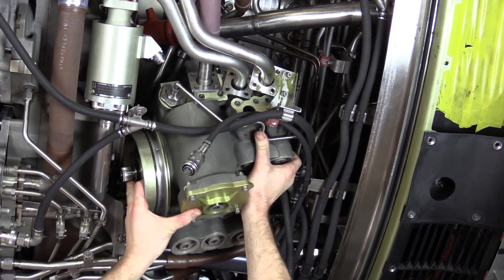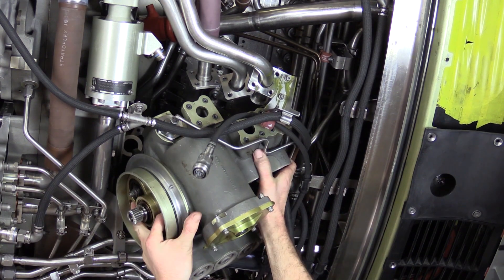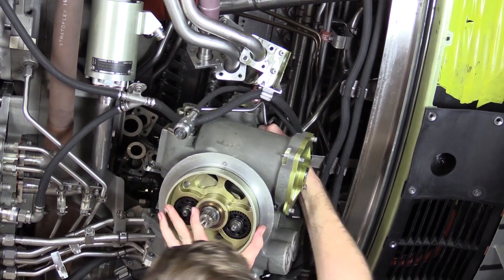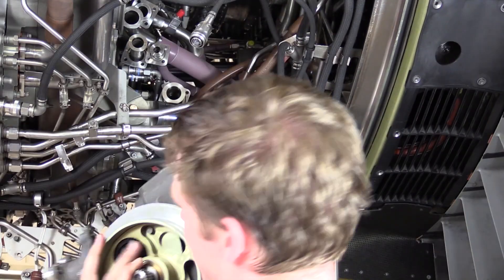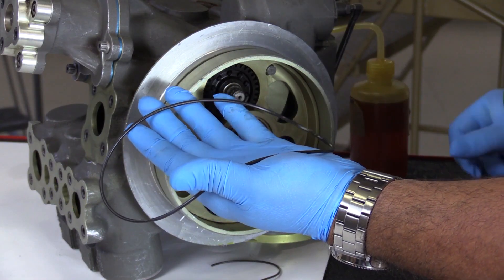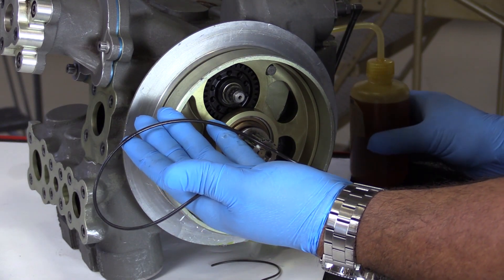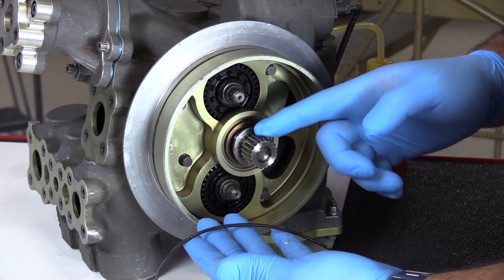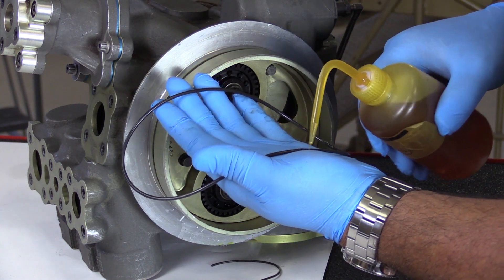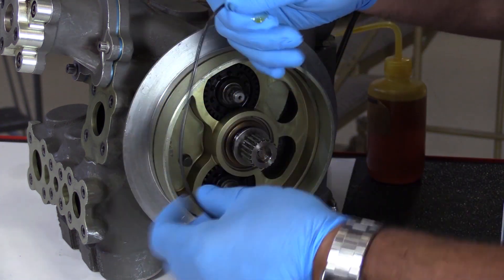There are a couple of electrical harnesses in the vicinity. Before installing or reinstalling the lube and scavenge pump, we are going to need to replace the packing on the pump housing. The lube and scavenge pump does not use a packing on the drive shaft, so we only have one to worry about. We want to lubricate that, as usual, with a little bit of engine oil to get a nice uniform coat.